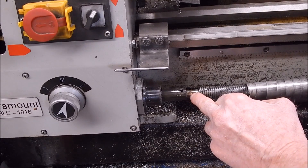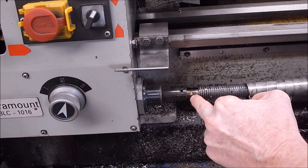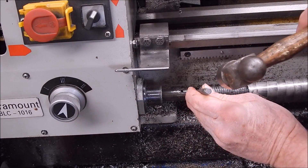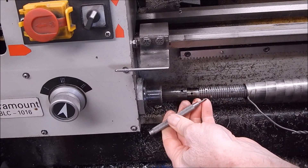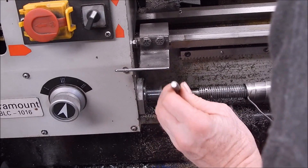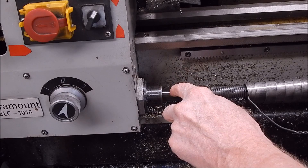You can see what's happened here. The shear pin's snapped, which is what it's designed to do. There's two shear pins on this actually — there's one here and another one here. This one is cast steel, this one is bronze. They were both cast steel but this one broke so I just put bronze in — that's just bronze brazing rod. It does a good job; it shears nicely and the end bits just drop off. Now it's just a matter of punching out the bit that's in there. That's a little homemade punch we made in another video — it comes in handy for this sort of work. The pins are out on both of these. Now it's a matter of bringing the shaft back and turning the gear train to line the holes up.